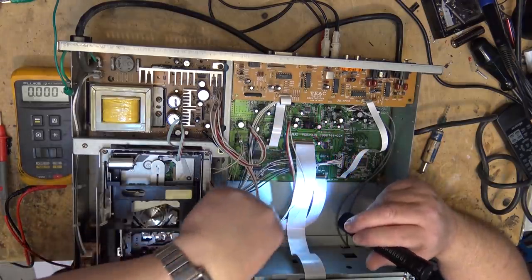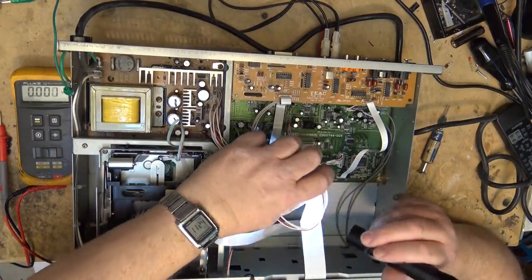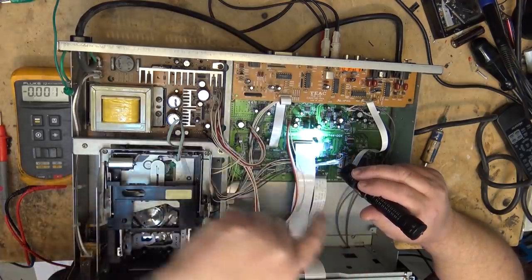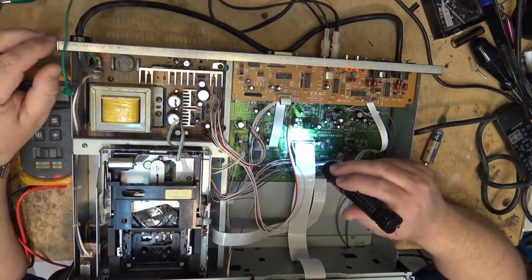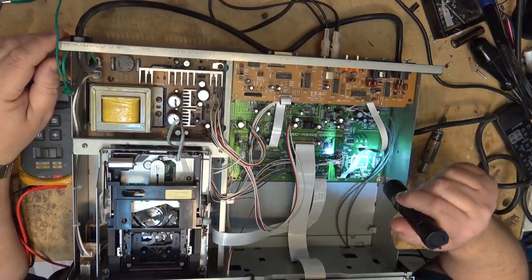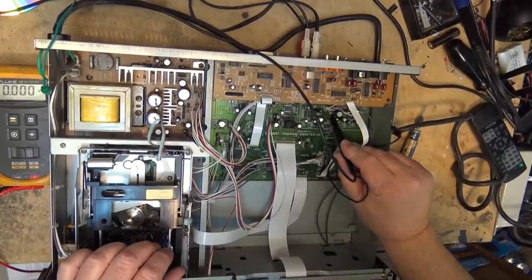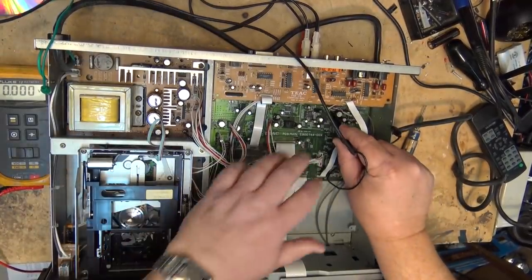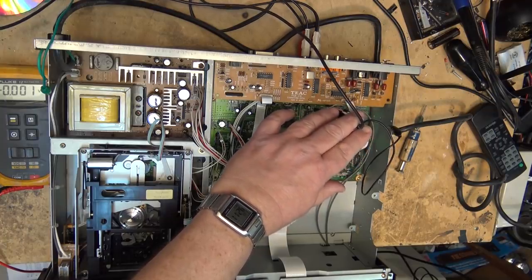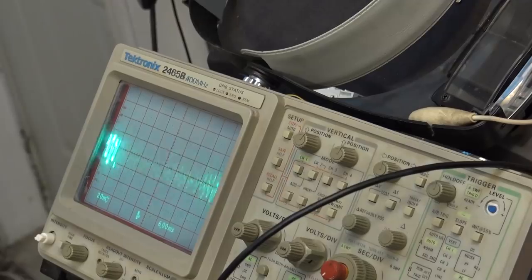So the analog audio input is in this area — here is the A-to-D converter and I think the D-to-A converter is over here, and it's marked D-to-A. So this is the playback side and the record side is over here. This is all the digital area of the board where digital signals are handled. I think they pass from this board up to another and come back. This board is your digital input, output, and remote interface. The audio is digitized and I would think the level meters are actually measuring the digitized audio at the digital level, interfaced on one of these connectors that goes to the front board.